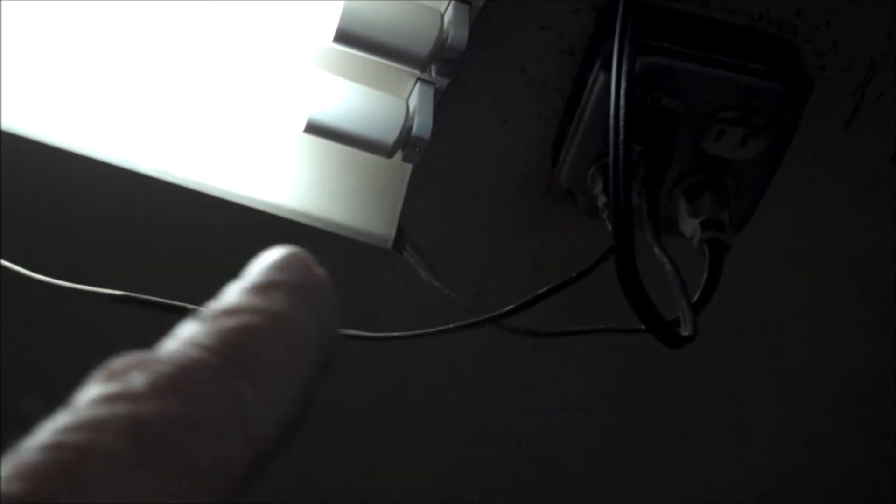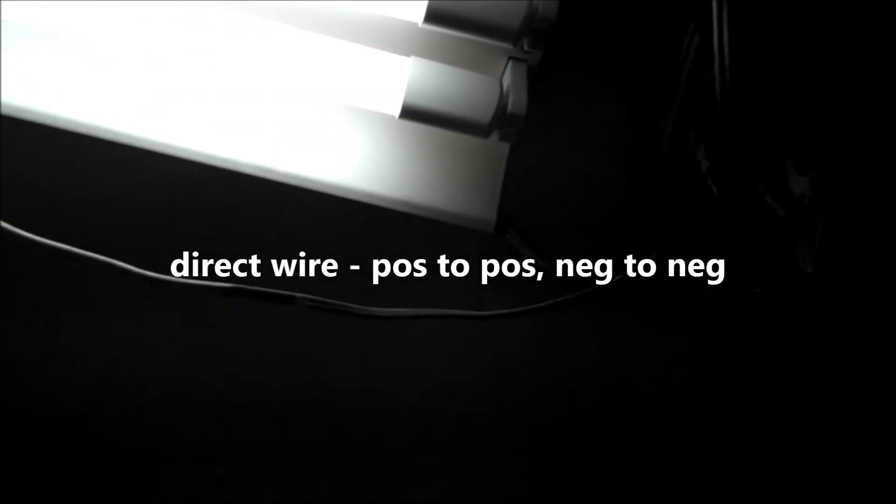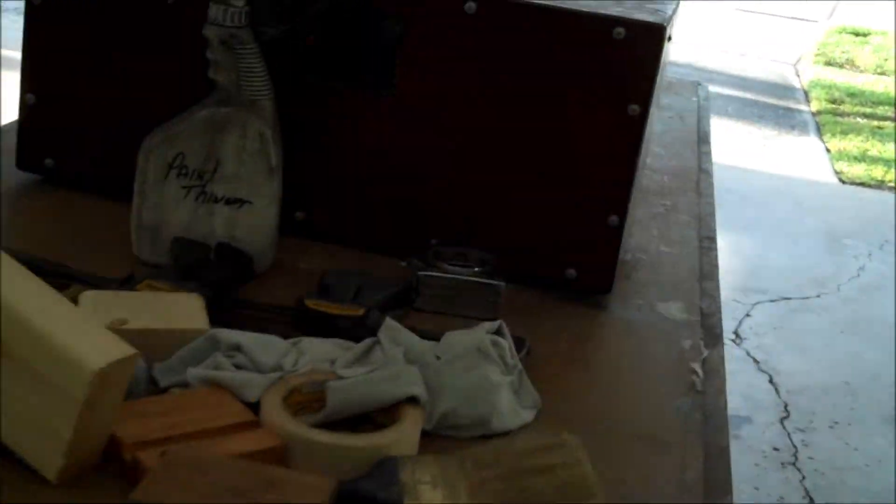Take the old shunted ones out, throw them away, get a non-shunted for each tube. I think I paid three dollars a piece and thought I was getting ripped off. Then they wire directly — negative to negative, positive to positive, straight to your power. They take 120 volts to fire. They're on/off, use no energy, last a million years, quiet. Just take an afternoon, however many you have, change them all out.